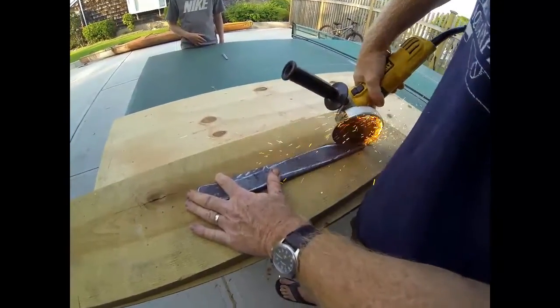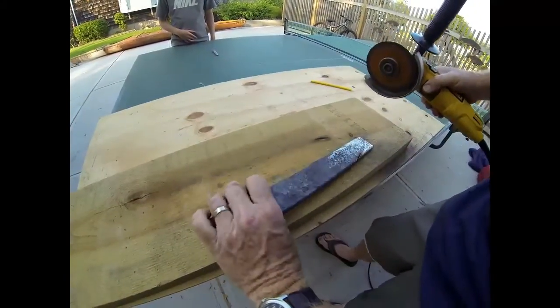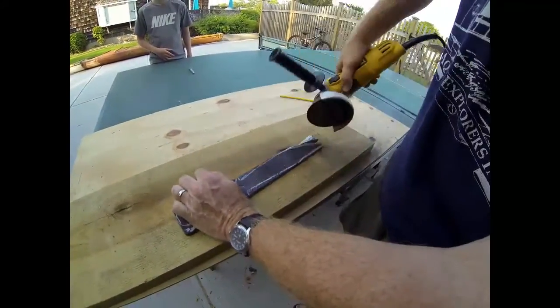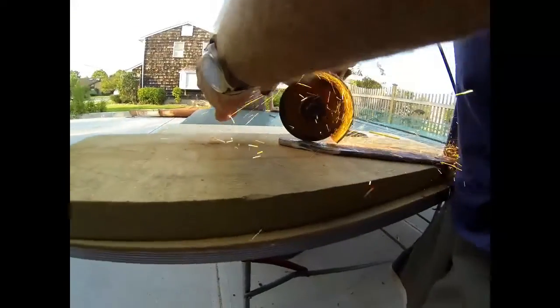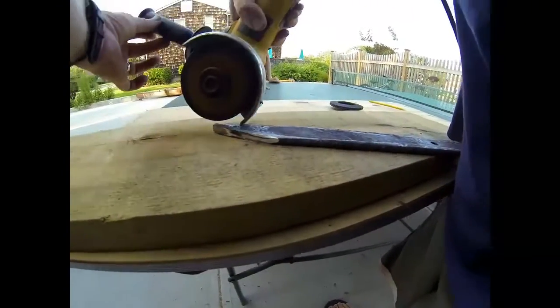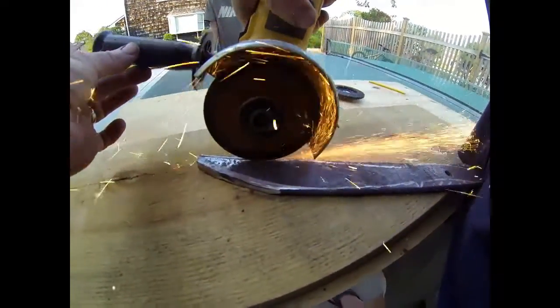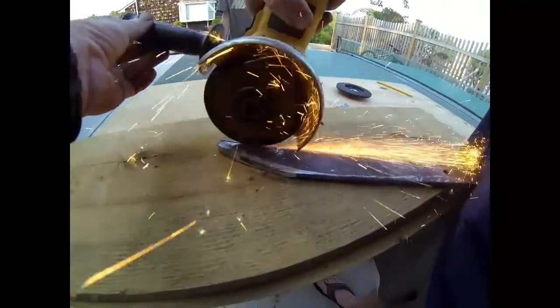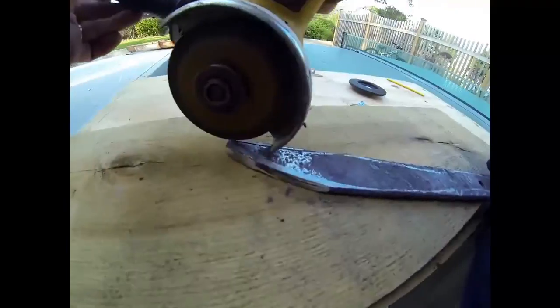We're going to start off with cutting discs, and we're going to cut out the basic shape of the knife and the handle. And then we're going to move on to grinding discs as well as sanding or flap sanders. Once the metal is annealed, it actually works pretty nicely. It's a little bit softer, and therefore you don't go through quite as many cutting discs. You can note that we can even cut a curve by just working the groove slowly forth. And it doesn't take too long to cut out the entire shape of the knife to the design that you've drawn on the raw material.